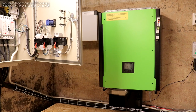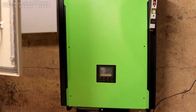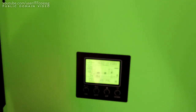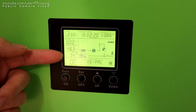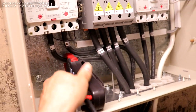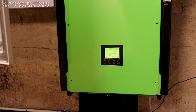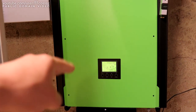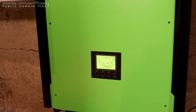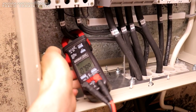I just turned on the oven to make dinner, and it occurred to me to keep an eye on the current because this thing actually lies. It's right now saying 74 amps, but in reality it's drawing 79. That's because the current meter seems to be just ignoring some internal losses from the 48-volt boost converter - it's always a few amps off in its own favor. So I need to keep an eye on that; we're usually about three or four amps more heavily loaded than the logs.